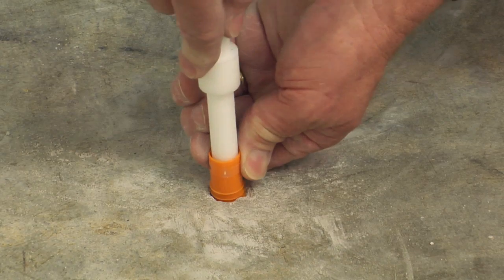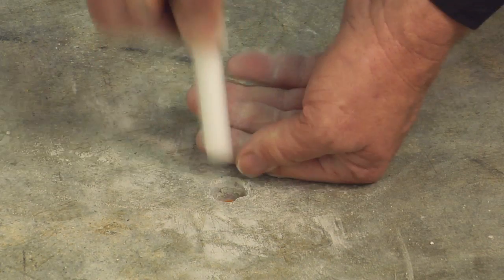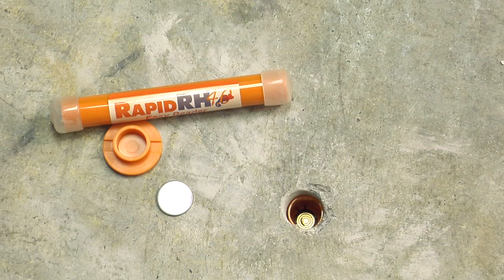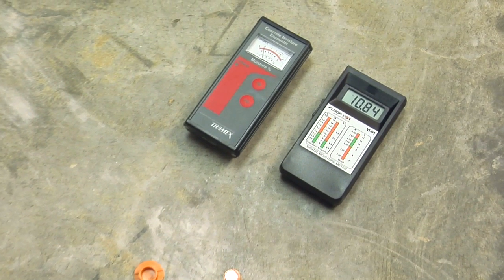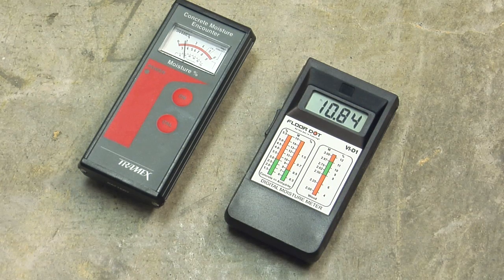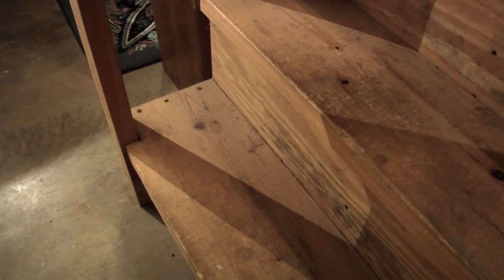Moisture levels of concrete slabs before, during, and after installation must be 8 pounds or less per 1,000 square feet per 24 hours using an anhydrous calcium chloride test according to ASTM F1869. pH must be between 5.0 and 9.0, or if using ASTM F2170 in situ probes, should be less than 90% RH. In some instances, it may be necessary to adhere the LVT to special needs areas such as steps, ramps,